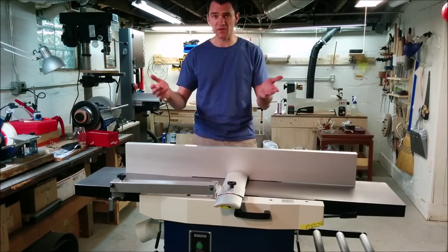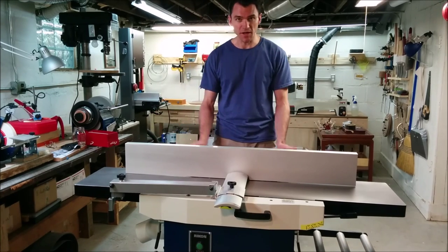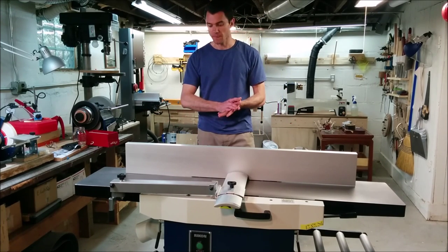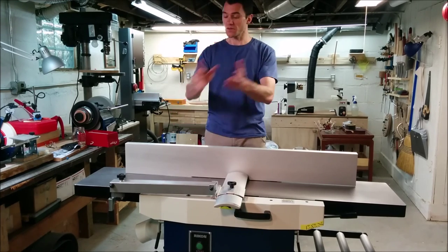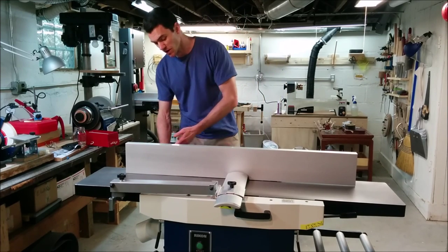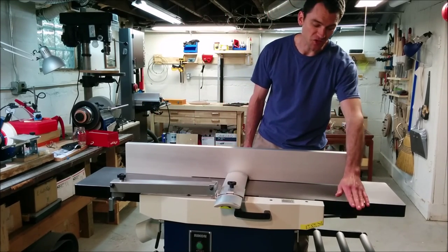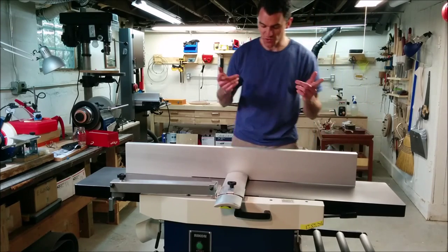As you can see, it has a European style blade guard and an end mounted fence. Otherwise, the features are very vanilla for this kind of jointer planer. The dust shroud flips from one side to the other. The planer controls are over here, with the roller control being this lever. And as you can see, it has a lever style jointer infeed control, not the two thumb wheels.